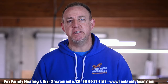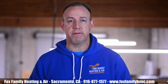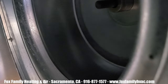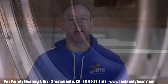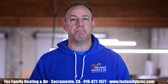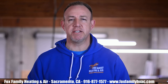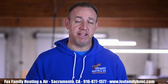Sometimes when it's bad like this, and you should tell your customer before you perform the blower cleaning, the clean blower wheel becomes light enough again that the motor burns itself out, because all this time it was used to spinning a heavier weight. So you could get everything clean and get it going again, and two weeks later get called back out because the blower is not working again because it's spun out. If you covered your bases by communicating properly with the customer, your company may not have to buy another blower motor. It just looks shady if you didn't.